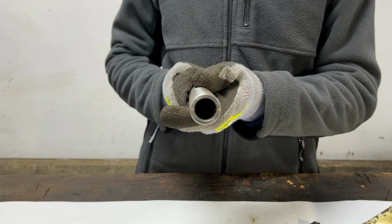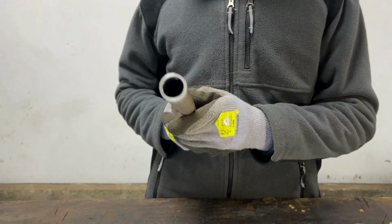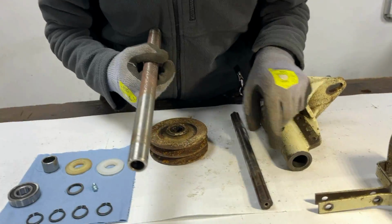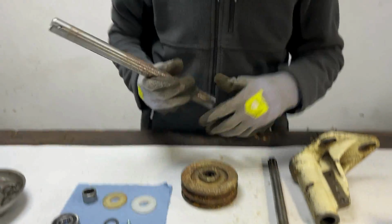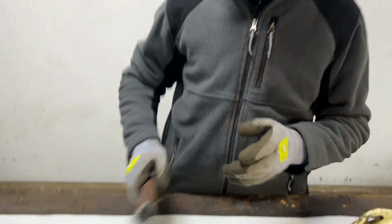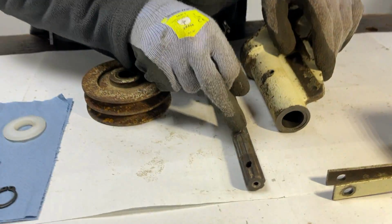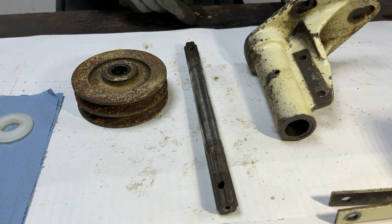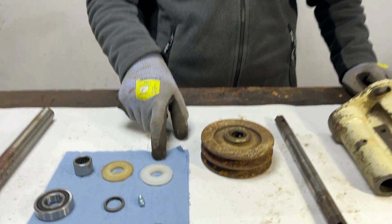So to combat this, or so that we can put it on properly when the shaft is on, we've got some of this bar, which originally looked like that, but we've just taken down in the lathe to look like this, with a flat face and a 3/4 diameter hole in there. Meaning that once this shaft is in there, we can use this to actually push the oil seal on there, and that fits quite nicely on there too, so that should work quite well as a kind of pushing bar. Then once that is on, we can probably put that circlip on that end, and then we'll move to the other side, putting on the big bearing, the other two circlips on here, and then the seal washer.